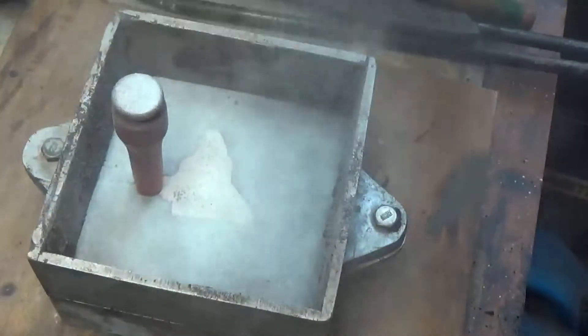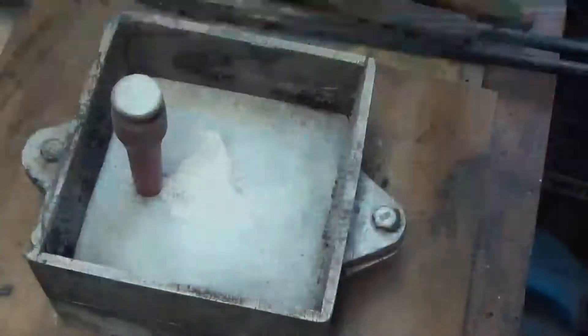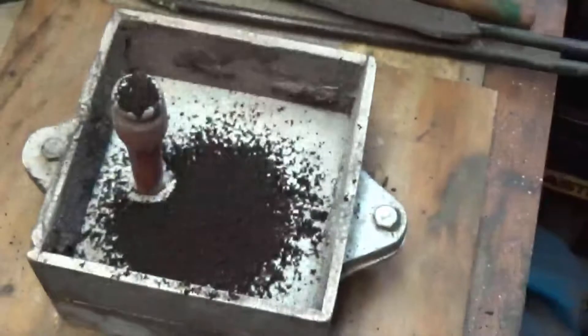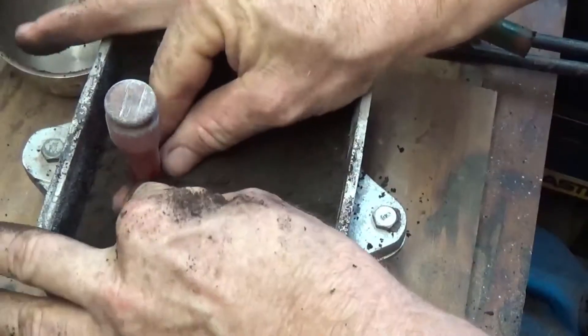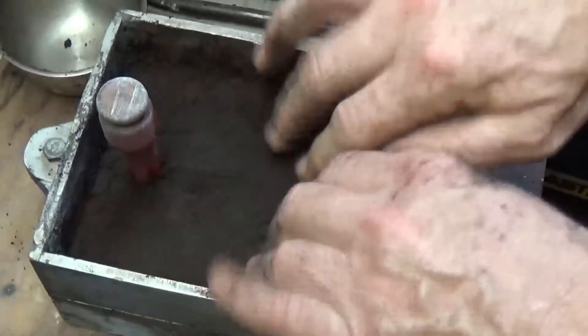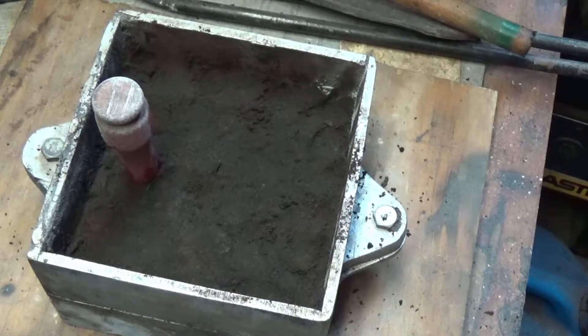Again, we're going to add some parting dust. You should use a respirator so you don't breathe any of this in. This will keep the surfaces from sticking together. I'll put some screened sand on here — I'm not going to be as particular on this side because everything is recessed right now. I just need to put about a sixteenth to an eighth of an inch just to cover it. From there I'll just start pounding the sand back in. There's the first layer — make sure it's nice and firm. We don't want any loose pieces. Now we just keep adding successive layers, packing them in.